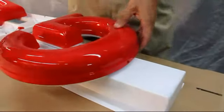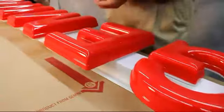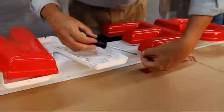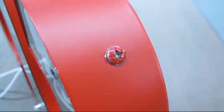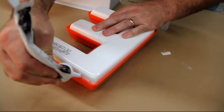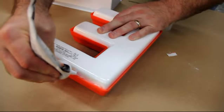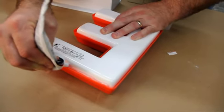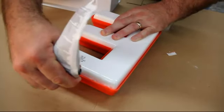This involves fitting the face over the can and screwing in small screws through your pre-drilled holes to keep the face secured to the back. We painted the heads of the screws the same color as the face return or trim. At this time, you also need to decide whether your face needs to be sealed. Some systems or regulations require running a bead of silicone between the face and the can to keep moisture out.